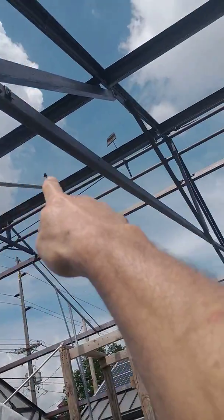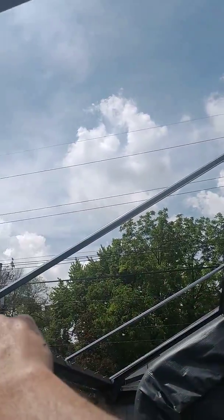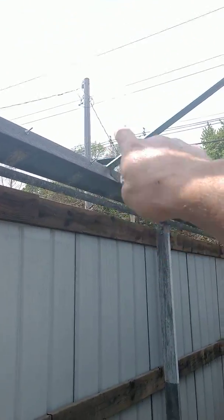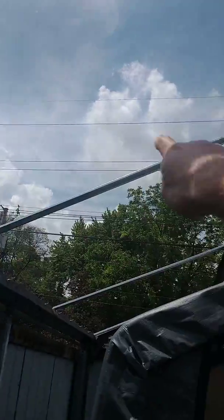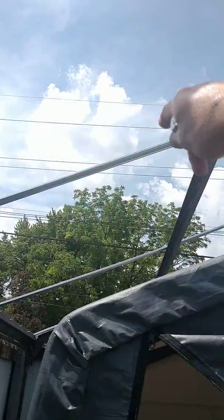We clamp it down and then drill through. We use these bolts to secure it to the C channels. Right there. Right there. And right there. And right there. And that'll be structurally sound. Plus the track is going to be bolted through along with the folded steel. There, there, there, and there. But where the track lays across the steel and doesn't have any fastener on it, we're going to use 5/8 inch aluminum rivets.